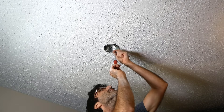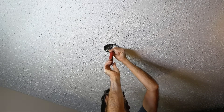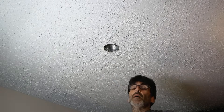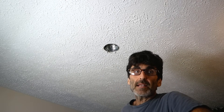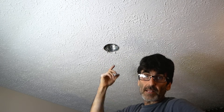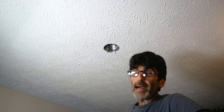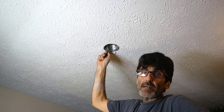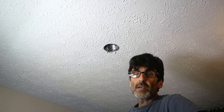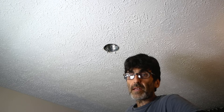Just tighten it up and don't forget the ground screw. I'm going to go up in the attic, bring the wire over here, poke it through, and staple the wire up in the attic — that's all for that. This is ready for a ceiling fan after I do that. You would just hang the ceiling fan as you normally would — I'm not going to cover the fan installation on video since they're all the same. That's how you hook a ceiling fan up to an area where you don't have any light fixture. If you enjoyed this video, click the thumbs up and subscribe to my channel — thanks for watching.